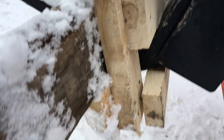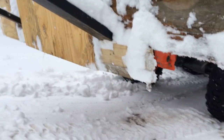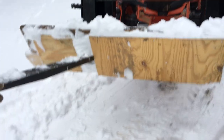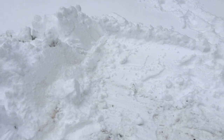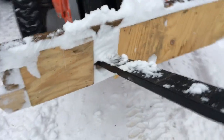I got a little build-up here with a couple of 2x4s that hold it out from the back of the pallet forks, which gives a little angle with the pushing action. Another problem I had is Snow Plow Version 1.0 wasn't staying all the way down on the ground, so I made this come down below the pallet forks. I might trim this extra bit off — it's leaving a little lump, which I thought it would, but I didn't want to get too fancy until I figured out this was working. I can adjust how much pressure so I can get close to the ground. If the ground starts to rise, I just pick up the pallet forks a little bit and put them back down when I go over a hump.